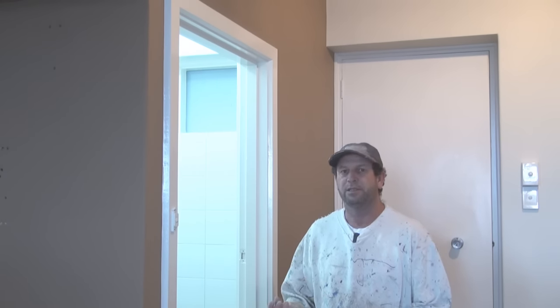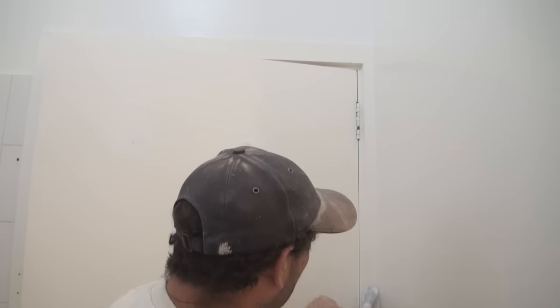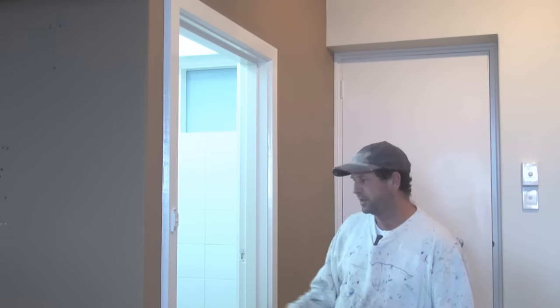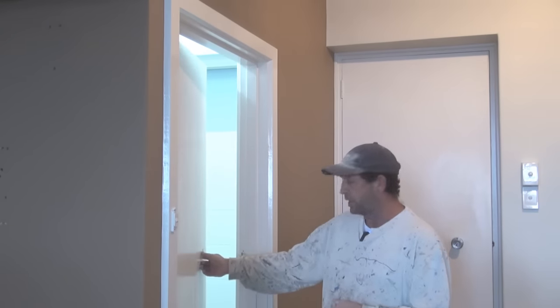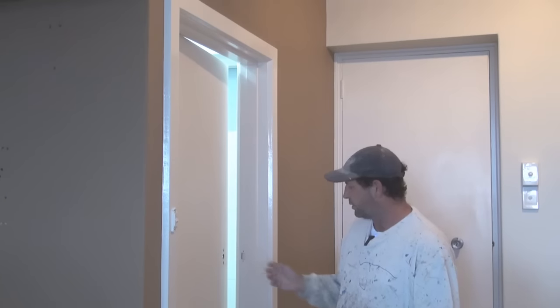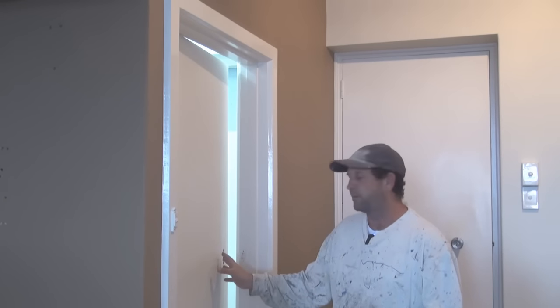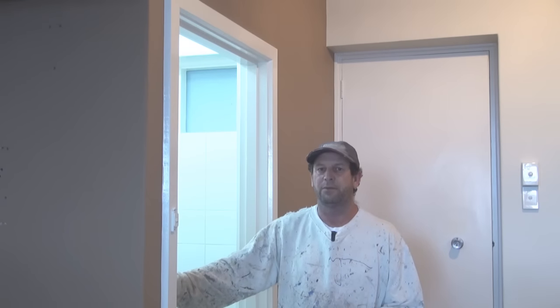The first thing you want to do is paint the back edge. The reason you start with the back edge is because of the door — if you painted the rest of the frame first, when you go to do the back edge you'll shut the door. The chances are if the wind catches it, the door will blow closed and hit your freshly painted door frame. So paint the back edge first, then open the door and leave it open for the remainder of the job.